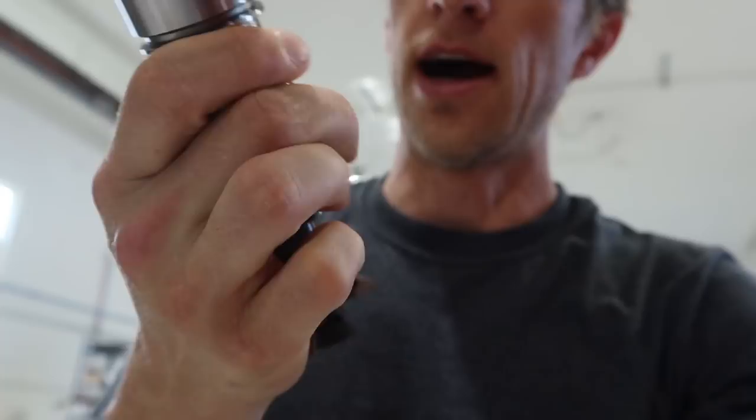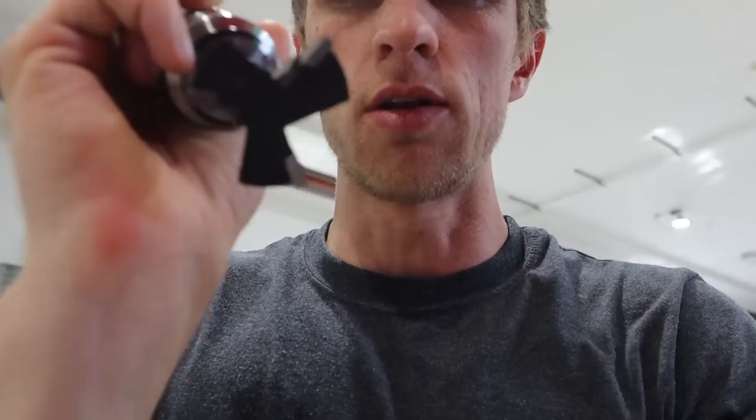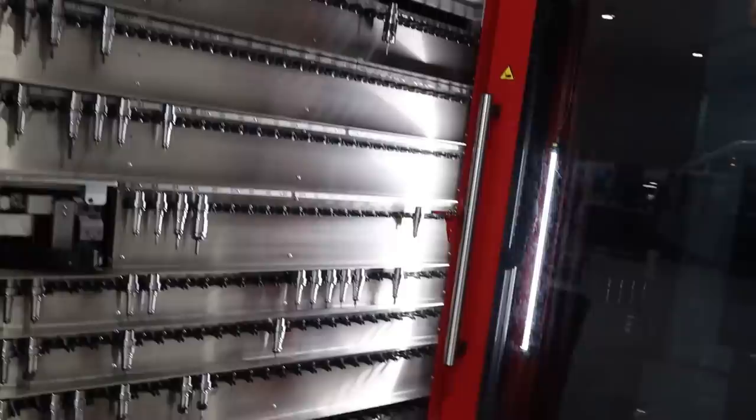Right now I'm putting in a PG-25 holder on an HSK shank with an AB Tools indexable dovetail end mill. I'm using this one — I've also got their smaller version — but I want this one for some of the pallets that I'm making right now. It's kind of a big honker for this machine, but it should be fine.